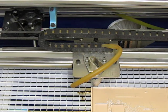Now I'm going to go ahead and cut this piece of acrylic. It's going to take three passes, and the table is going to rise one millimeter between each pass, or at the end of each pass, so that we're lowering — if you will — the focus in the acrylic itself.